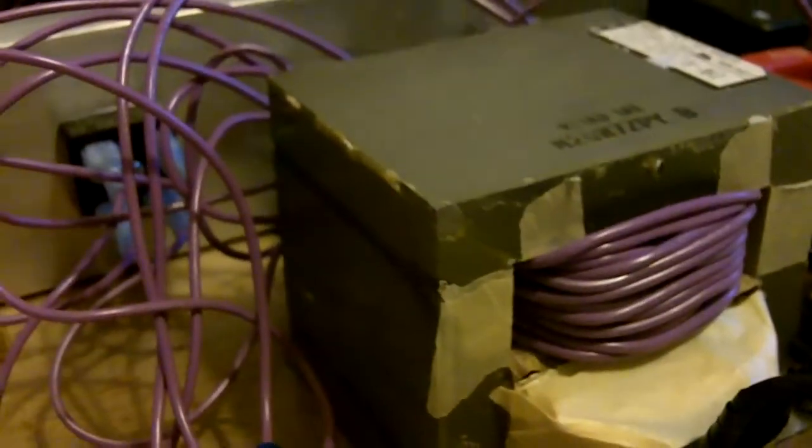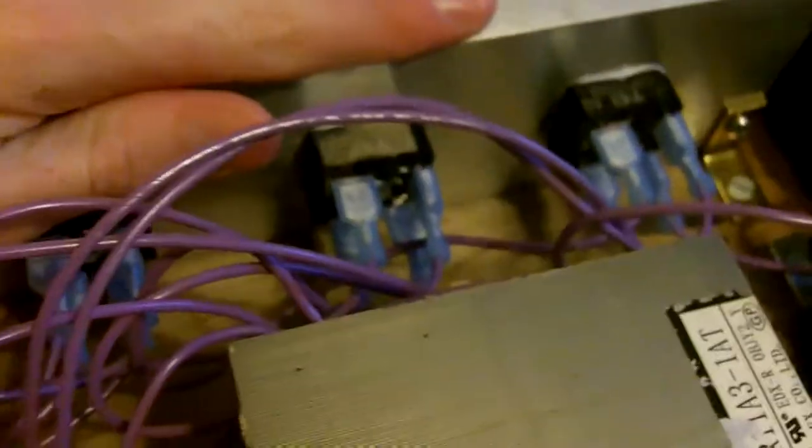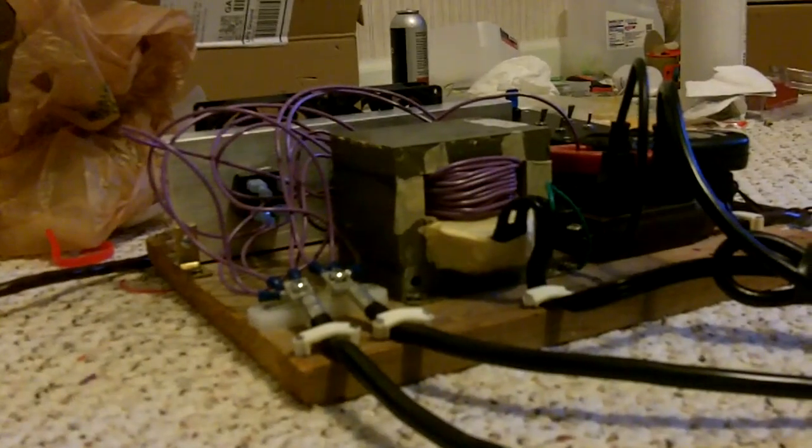Just now I wasn't really running at my fullest power. My rectifiers stay pretty warm but they don't really get hot. I am using parallel rectifiers, just to let you guys know, and it does seem to be working fine. The only thing that's limiting my power now is my microwave oven transformer right there. You can see the rectifiers here — they're all attached to one heat sink and they have two fans on them, which keeps it real cool. The parallel rectifiers are working great for me, even though some people say it's not good to do that.